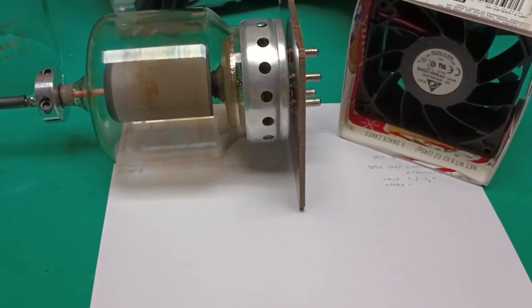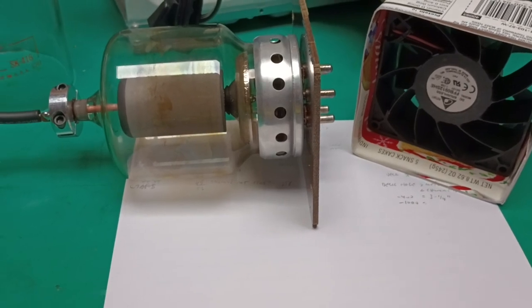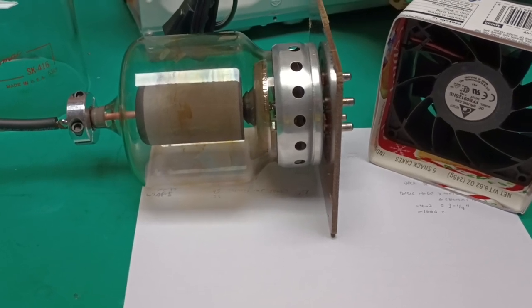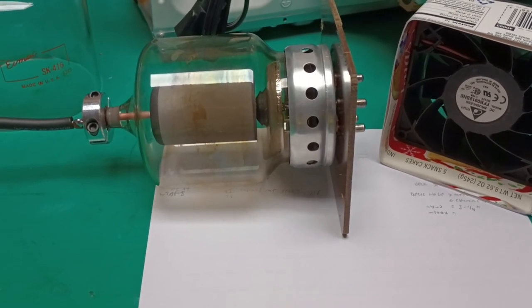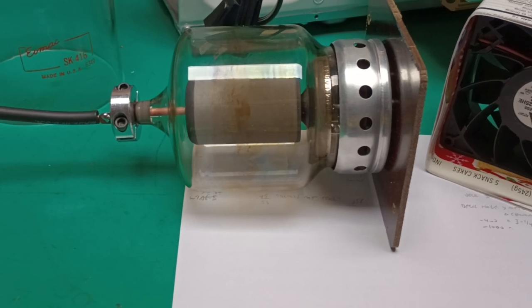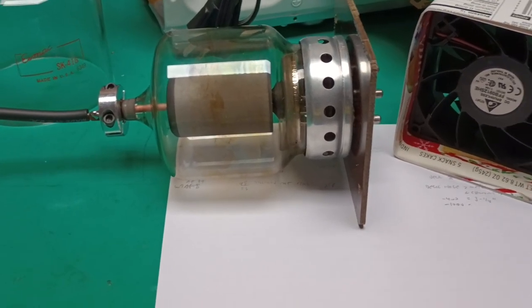It must be at a certain minimum pressure for the correct air density, because it takes the correct mass of air. Flow isn't enough and pressure isn't enough. It has to be at least certain figures on both. For this tube, it's about 15 CFM at half-inch water column, and half-inch water column implies pressure.